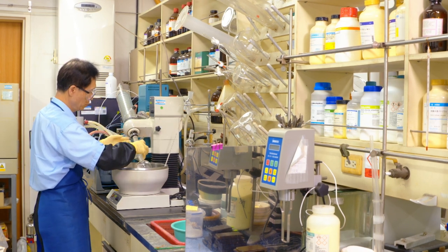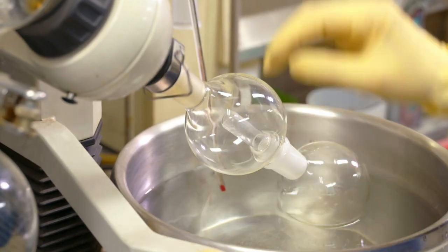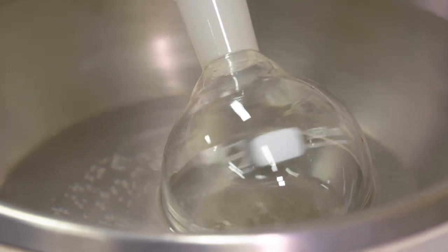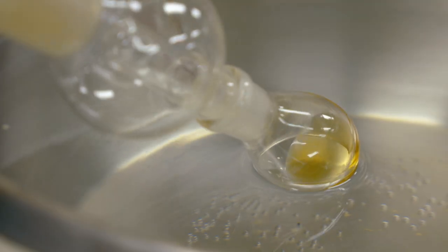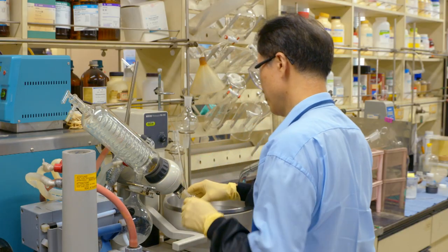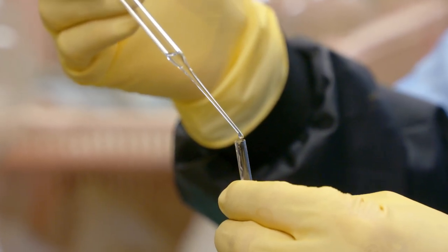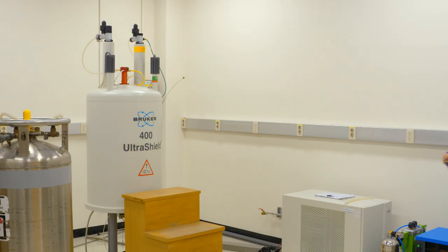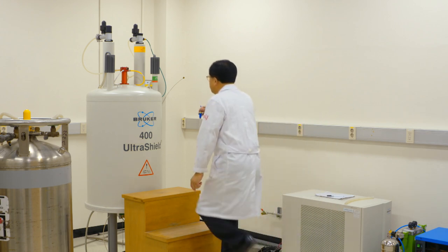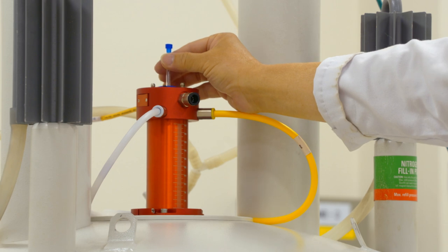When Ott is applied, the high content of urushiol molecules prevents moisture, and the polysaccharide keeps out oxygen, therefore preventing oxidization. A sturdy coat is formed on the surface of the wood or metal. This adds luster and makes it impervious to change. In other words, the chemical structure of urushiol is what determines the quality of the Ott.